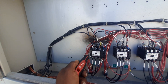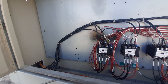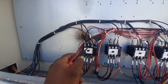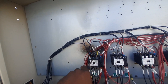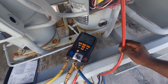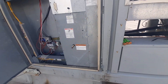I'll tighten them up and we'll restart it and see if we get any change in pressure. My amp draw wasn't low or anything — normally if it's not pumping you get around 10 amps, but in this case my amps were like 26. I just want to reverse it to see. After switching the wires, we're still sitting at 143 over 196 — this unit has gas in it. Let's restart and see what happens.